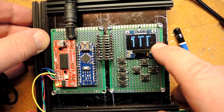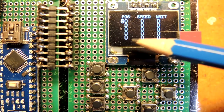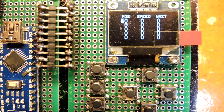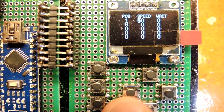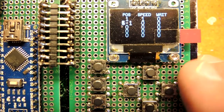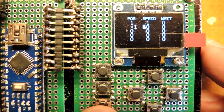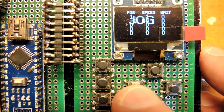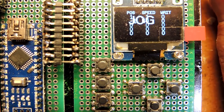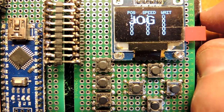Let's zoom into the operation. Here's the program — this thing can run through five different positions programmatically. It'll run to a position at a certain speed, then wait if desired. So I can say: go left for one inch, do it at the slowest possible speed, wait for zero seconds, then select a negative direction and press run — and off it shall go. Another mode I programmed in was a jog, so I can move the motor back and forth a little bit to position it as desired. The code is on my blog — I'll put the URL on screen — and I'm sure there are a few more things I'll want to add as I keep developing this camera slider.